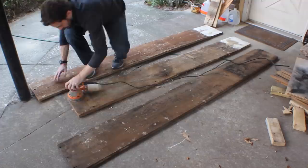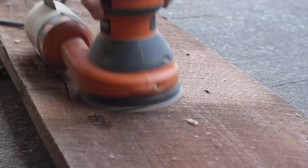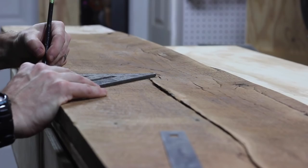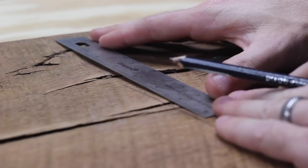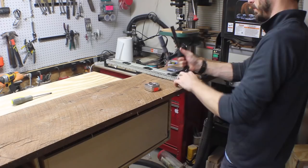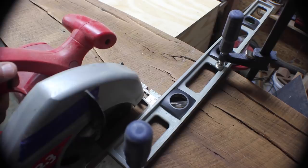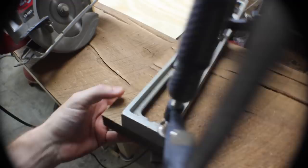For the face of the bed, I was using some reclaimed oak barn wood that my grandfather gave me from Kentucky. I sanded it down just enough to get rid of the rough stuff and the dirt. On the cabinet, I laid it even with the back end of the bed, and then made a mark right in the center of the divider. Since this wood is pretty bowed, a flexible ruler made it much easier to draw a straight line. Then I measured over an inch and a quarter from my cut line, and put on a straight edge to use as a guide for the saw. A straight edge like this makes it a lot easier to get a straight cut on a piece of wood with such an irregular surface. I used the same process to cut both the other drawer fronts.